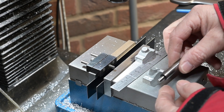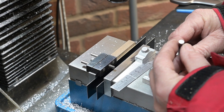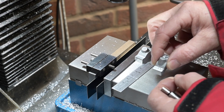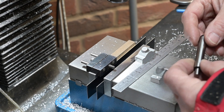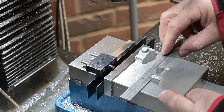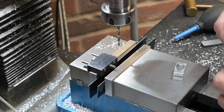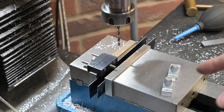I'm going to have to fix that — I might be able to do something with that one, I'm not sure. I know where the error is now, so I'll just move it forward a millimeter and see what I can come up with. It's a bit frustrating — I just haven't been doing anything for such a long while and I forgot that the new edge finder is six mil and not four mil. Anyway, I'm going to have to make something to go in there and fill that hole up. I'll bring you back when I'm doing that.